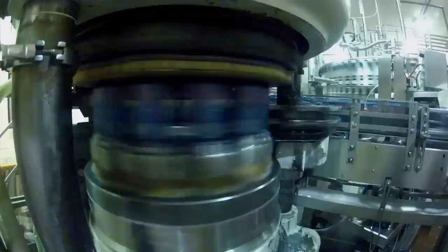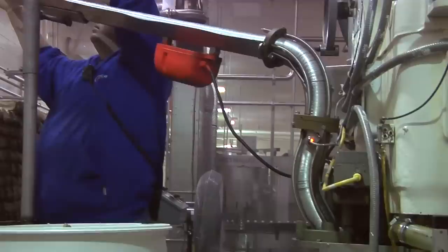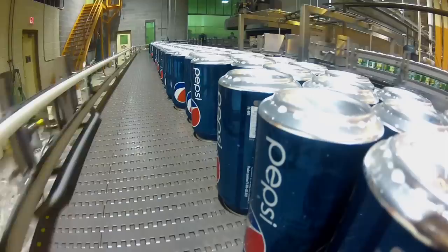There's a 72-valve filler. Once the can goes through the filler, it is then seamed through our seamer. We have a 12-head seamer. The filler operator controls the filler and the seamer, and he's on the platform loading sleeves of lids into the seamer — there are 660 lids per sleeve. The filler speed and seam speed is about 1,100 cans a minute.